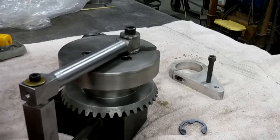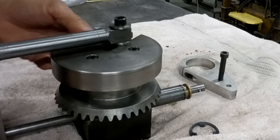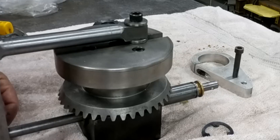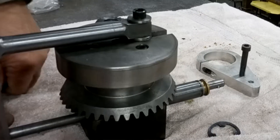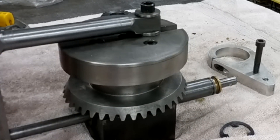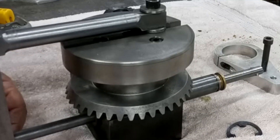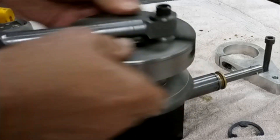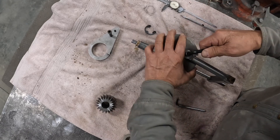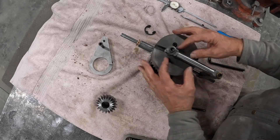There's not a lot of room for jumping around. So there you have it that way — as this thing turns, it will cause this to go in and out. So I need to lock this in place, like that, and that's locked. As this turns, I need to make sure I have this locked on here. I want this out to here. You want to make sure that your travel doesn't come back and hit here like that. So I need to move this out. Now when this travels, you can see that it's still pretty far. Let me lock this one in place too — it helps to lock everything down. Now you can see, in relation to this, how far that moves. It's actually moving double the distance, naturally. So that's your travel.